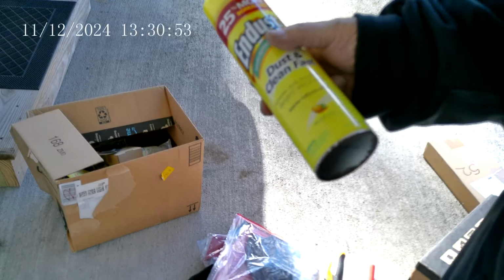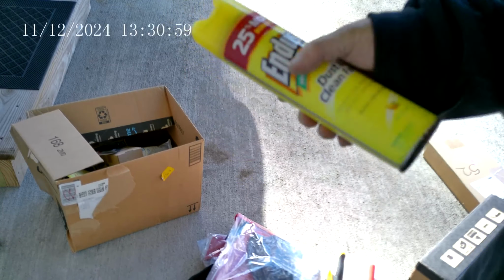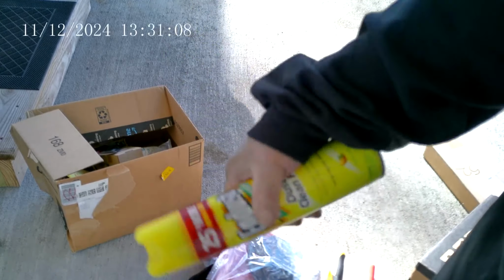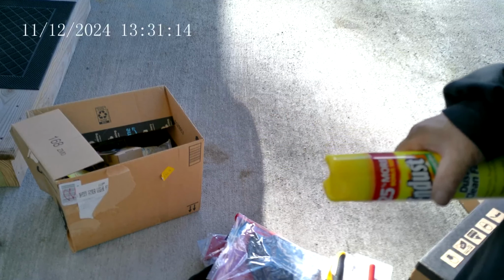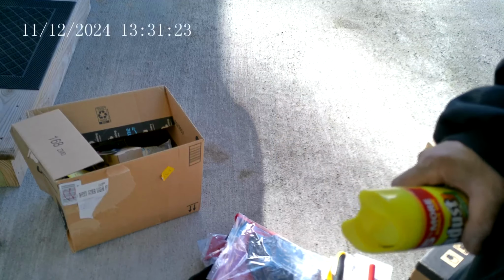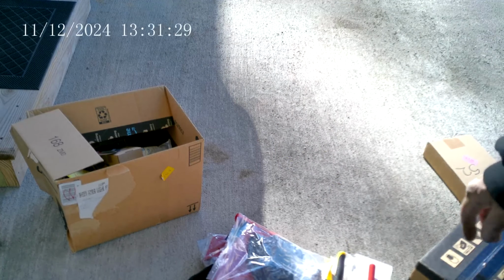Okay. This is a little known witch's brew thing when you're MIG welding. Even though with your machine they say to make sure the ground is your stinger and the hot is where the ground was, to minimize the spattering, well, they do have an aerosol that you can buy that sprays down. Nozzle gel works pretty good too if you just take a little bit on your finger and wipe the area down because it washes off.